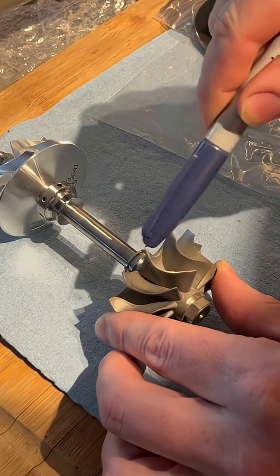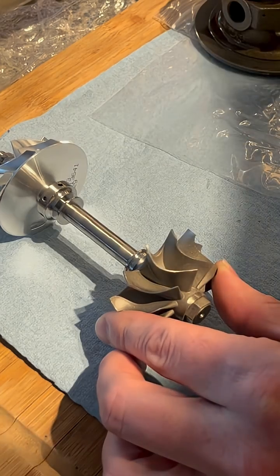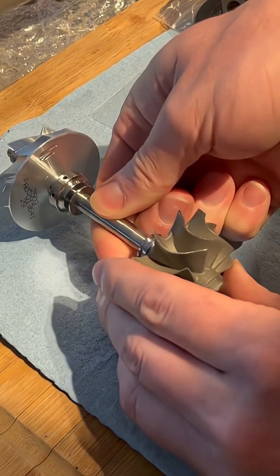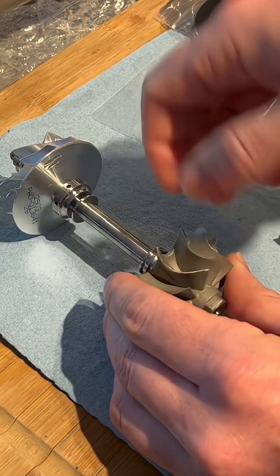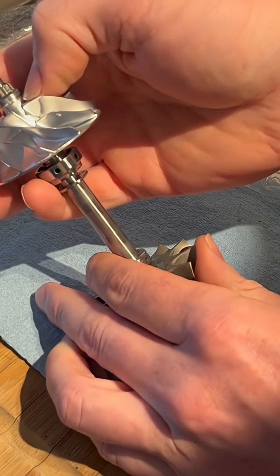So the center point is right here on the turbine side, and then if you flip it 180 degrees, you'll notice the original individual balance material mark, and then subsequently there's a VSR balance mark right here.